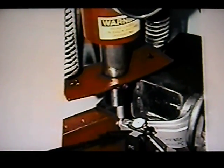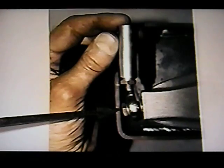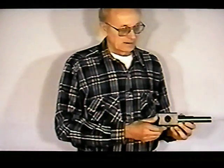These photos give you an idea of how we set the pitch horn up for deflection testing. You can see the dial indicator we used to measure deflection. We applied pressure to the pitch linkage to observe the failure mode of the parts. In the third photo, you can see we actually bent the rod end trying to apply that much load — we also bent the attachment bolt. This easily substantiated the fact that we have achieved the safety factor that will allow us to reach our desired fatigue life.